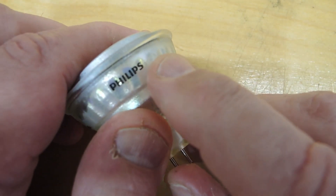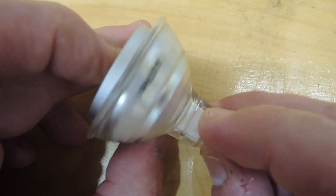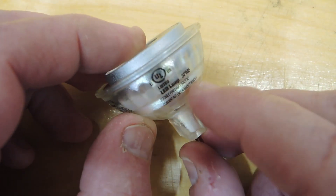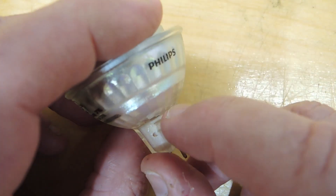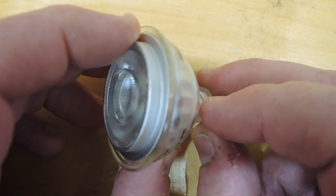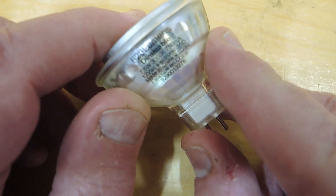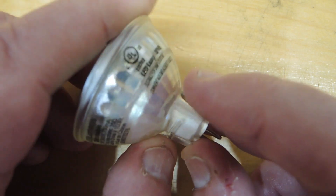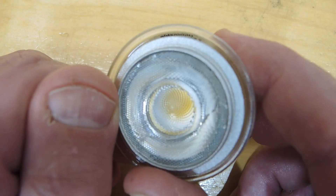If you are a fan of my channel you would recognize I did a lot of LED teardowns earlier on. This Philips bulb is interesting as usual — there was a tremendous amount of design variation, and this one's no different. Philips always tried something new. This one has a glass envelope, and glass is prized for its ability to conduct heat away, which is very important. It's a 620 lumen bulb and a 50 watt replacement. It's a terrible form factor for LEDs — it's very hard to get heat out of them even though they have very intense light.